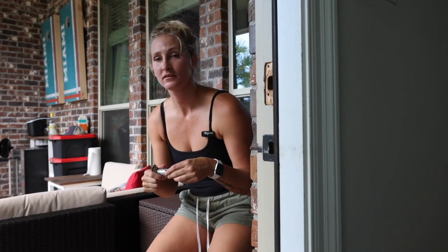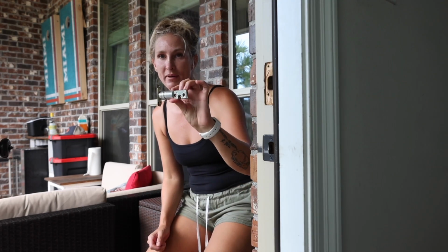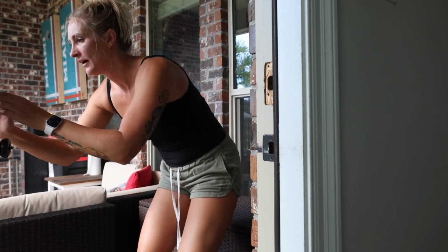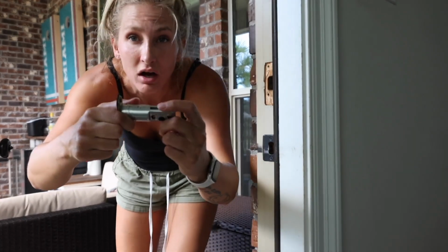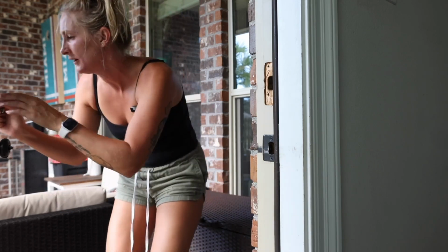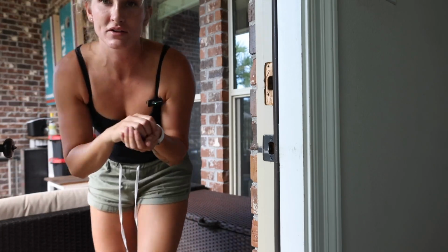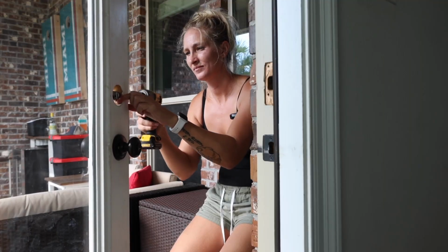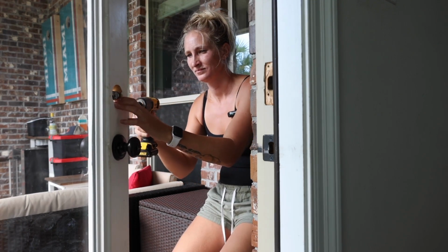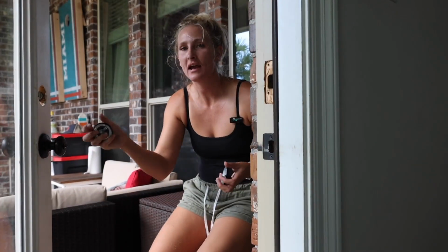First thing I'll be doing in the first part of the top half is putting the deadbolt itself back in. It fits right into the spot that is already there, so I'm gonna put that in. Making sure that the top is in the top and not the bottom, otherwise it won't work. So checked, made sure that was correct, and that fits right in the hole so I can screw it in. And that's that bit.